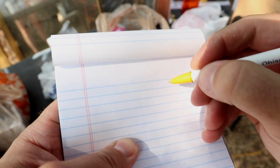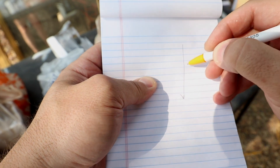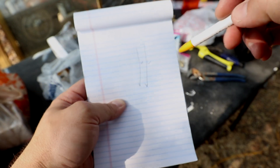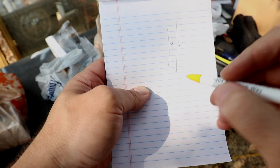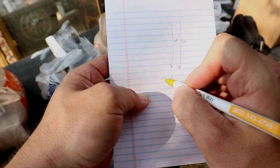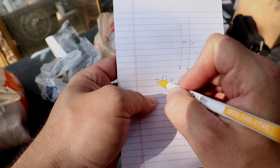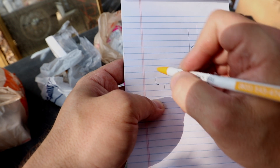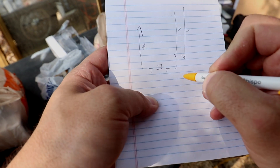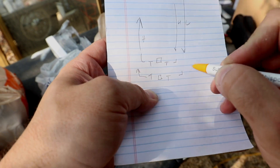So here's what we have: we have fresh water coming from the shower as both cold and hot — so we're interrupting the supply, cold and hot. We're going through an elbow and then a T, and then we have a valve, another T, and then an elbow, and this goes back as the hot supply. Then the cold supply is mirrored and that goes back.